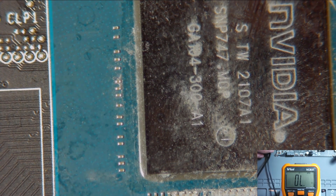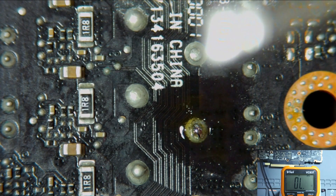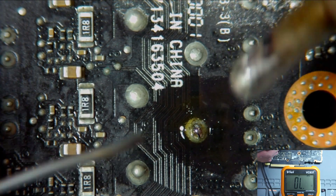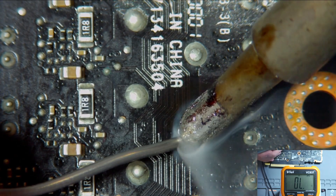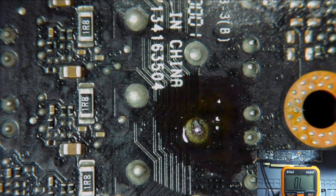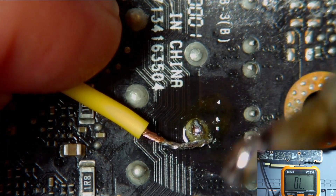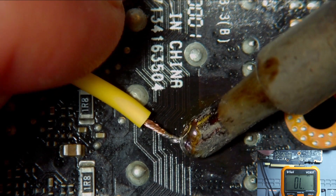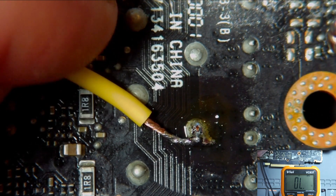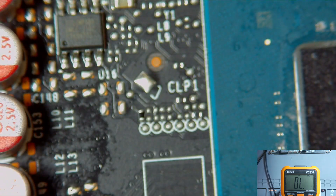So what we're actually going to do now is turn the card over, solder a wire to ground those phases, and hopefully this will increase the current draw so that something will get warm with the thermal camera. We're placing a bit of solder on one of the inductor outputs — these are the inductors connected directly to the shorted 12 volt phase. We're attaching a wire to simply ground that phase and force those phases to pull more current.